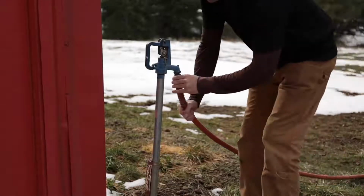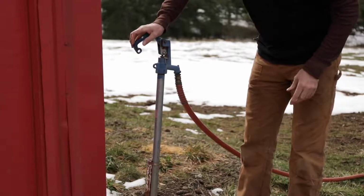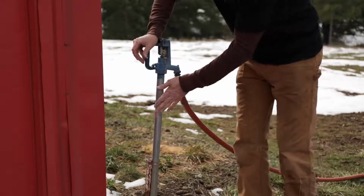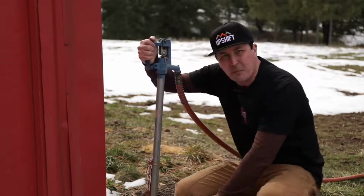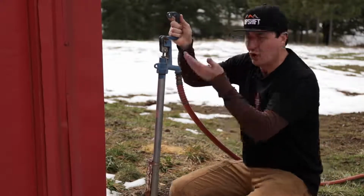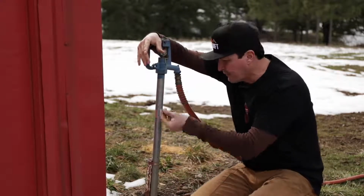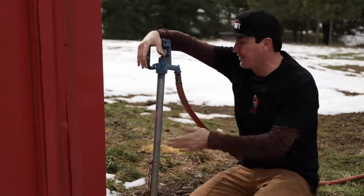We'll hook up our hose here. I often get questions about these strange spigots that we have, mostly from our friends and subscribers in Africa. These are for cold weather. If you live in a cold climate, your spigots and standpipes will all freeze. So the valve is way down in the bottom underneath the freeze layer. When you open this up, it charges the standpipe so you can use your water. When you're done and you close it, it closes off way down below, and there's a weep hole that drains the water out of here. So when you see these in rural or alpine areas, that's what they're for.